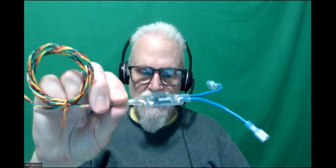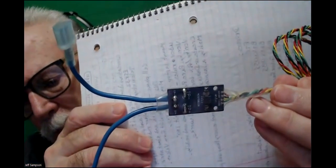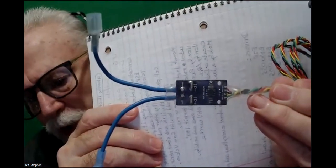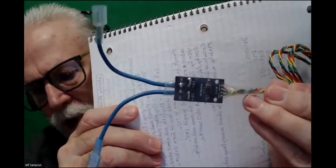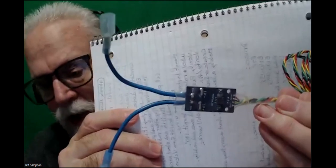Then there's the bigger one - it's got this big giant IC with three leads on it and two giant power connectors, big heavy tabs, just put on a board. On the back of the board you can see the two big terminals labeled IP-plus and IP-minus - those are the two main power leads. Somebody mentioned the traces are only good for about 30 amps even though the board is rated plus and minus 50 amps.